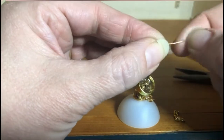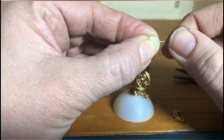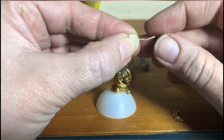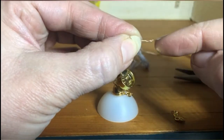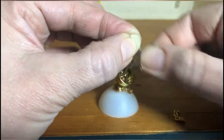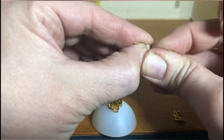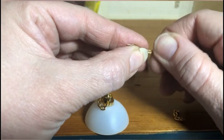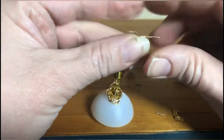I like to use my fingernails, but you can use the back side of scissors, a box cutter, or anything with a blunt edge that's not going to cut the wire. We need to nick through the insulation just enough — you can see the shinier part in the middle where the break is. Now twist the insulation as you're taking it off, because there are five or six separate wires that will fray and stick out. It's easier to twist with the insulation still on. Do the same on the next side — keep the insulation on as long as you can to get it all twisted. I know it seems excessive but you'll be thankful in the end.